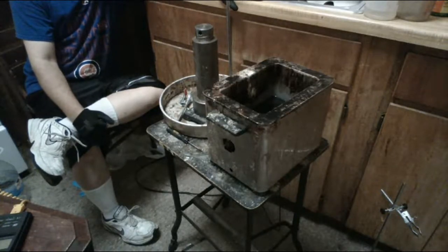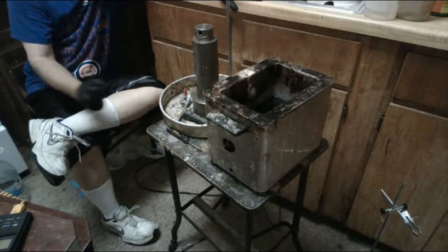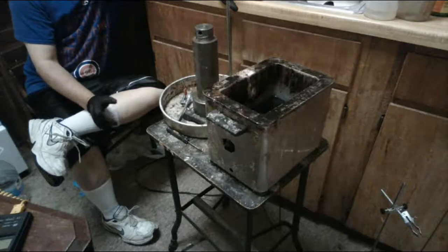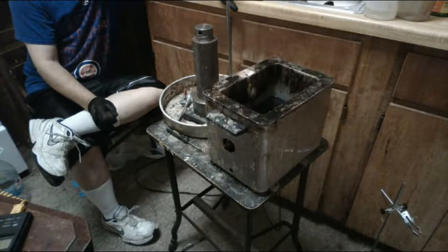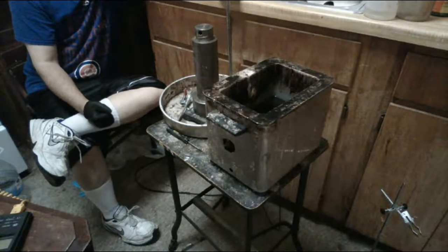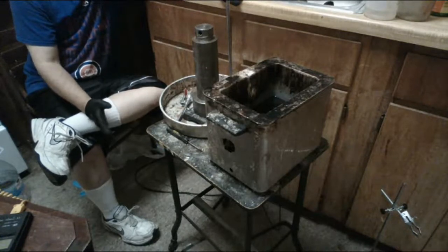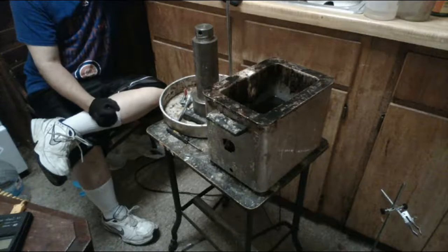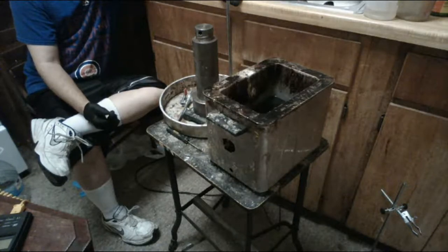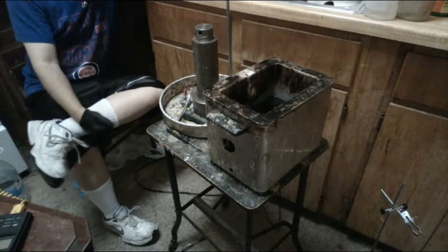Sounds crazy, if it's uncomfortable. If you ever look, there's a picture of them molding at the Edison plant in 1900. You'll notice they have their wool pants on, but they're in their cotton shirts. They don't have their vests and everything on. It must be very hot in there. And the reason is because records mold best when the air temperature in the room is about 90 degrees.